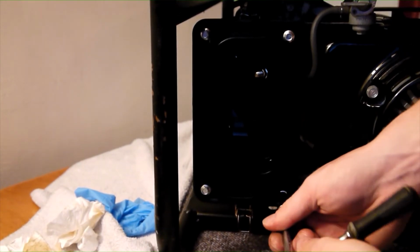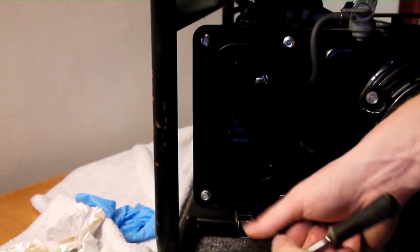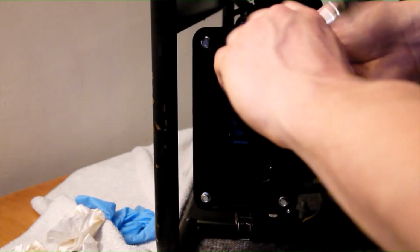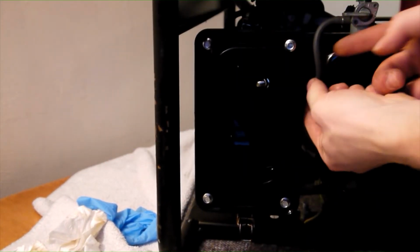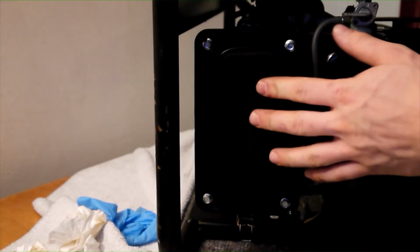Having reinserted the air filter housing into the air filter box, proceed to tighten the 4 bolts in each corner. Once this is completed, you can reinsert the crankcase breather into the air filter box on the top left and reattach the fuel hose rubber bushing on the top right. Simply locate the new air filter medium into the filter housing. It should be a snug, tight fit.